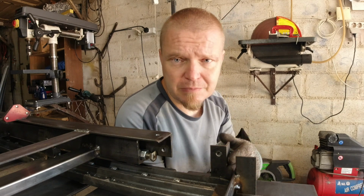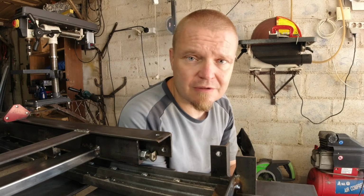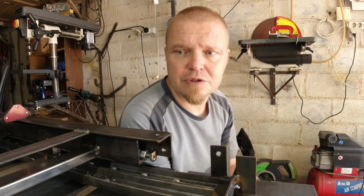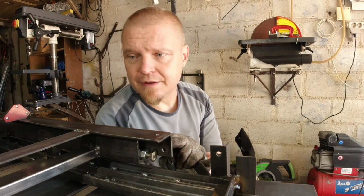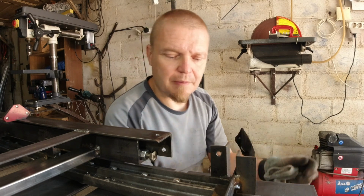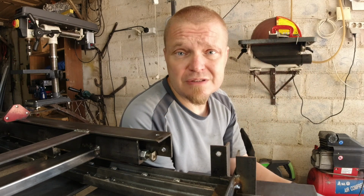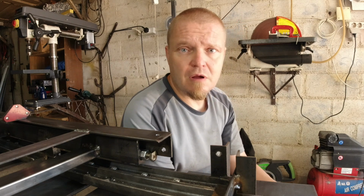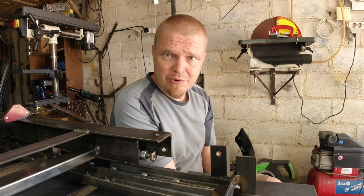It's total overkill to start bending these in, where I could just weld a piece of flat bar on this one and drill a hole. However, that's not really how my head works, so I think I'm gonna have to cut these, and then I will probably clamp them to the legs, and then I will weld them up again. Hopefully that should somewhat satisfy my inner perfectionist. Yeah. End of Inside Brain tour.